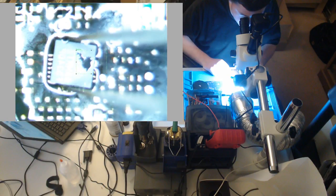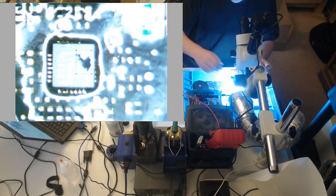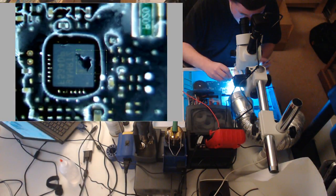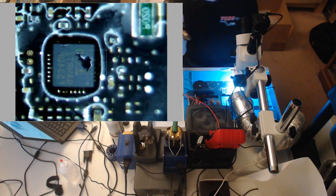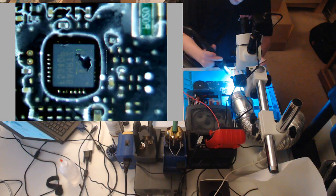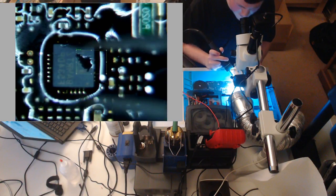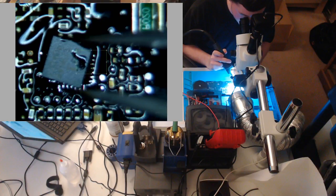Now, I'm pretty sure most of you here, if not all of you, know how to solder this chip properly. Don't worry about it being lined up. What you do is get your hot air, low airflow, like 30, and do I have that on the right way? Yes, hopefully. Don't put your ISL on the wrong way either. Bad things will probably happen.